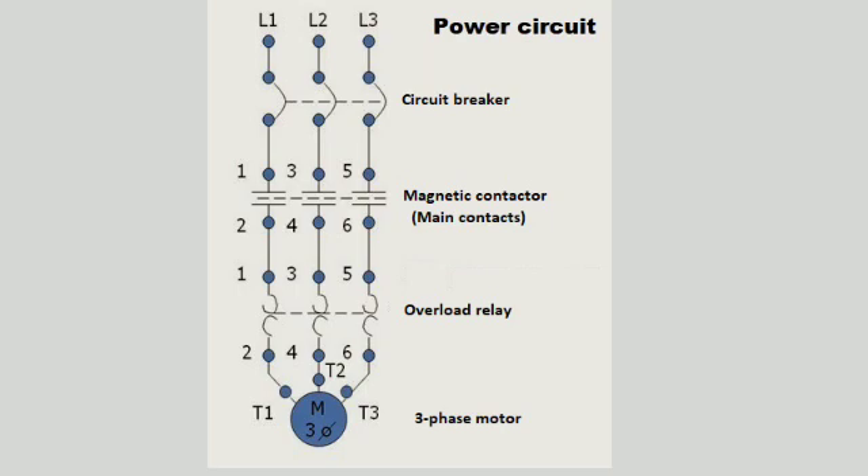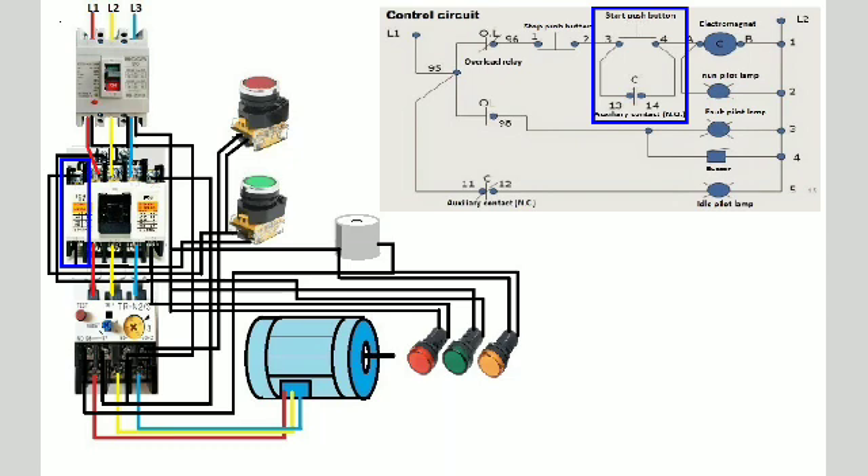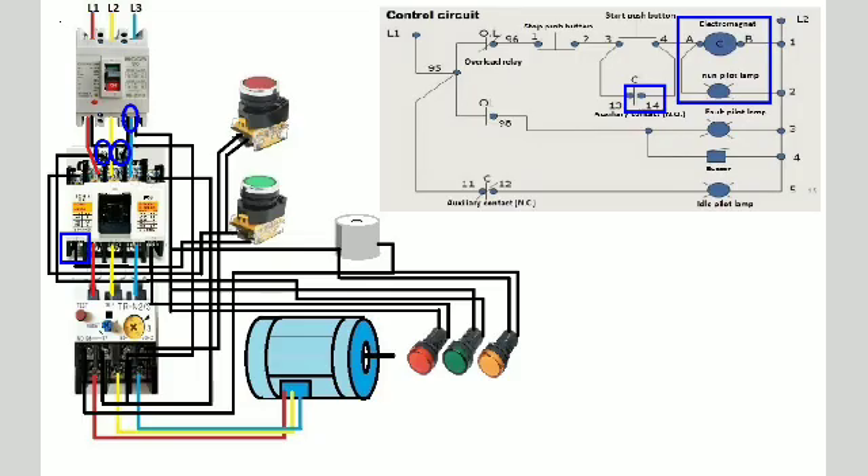Let's now go to the two portions of its schematic diagrams. In the power control diagram, the three-pole circuit breaker is connected between the voltage sources — line 1, line 2, and line 3 — and the magnetic contactor. Next to the circuit breaker are the normally open main contacts of the magnetic contactor, followed by the normally closed contacts of the overload relay. From the load side terminal of the overload relay, the connection goes to the three-phase motor. The next terminal of the overload relay is connected to the stop push button in series with line 1 voltage source. The stop push button is then connected to the start push button, which is in parallel with the normally open auxiliary contact. The normally open auxiliary contact is connected in common with the start push button terminal in series with the electromagnet and the line 2 voltage source, as shown and enclosed by the blue circles and squares in the diagrams.